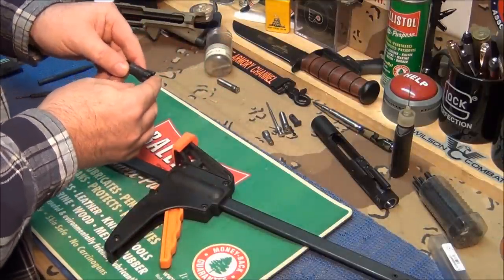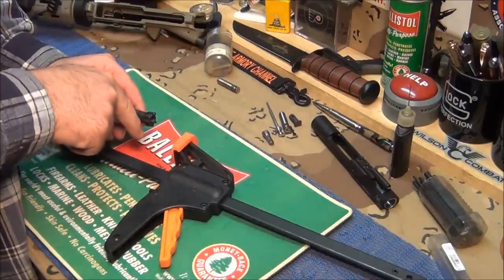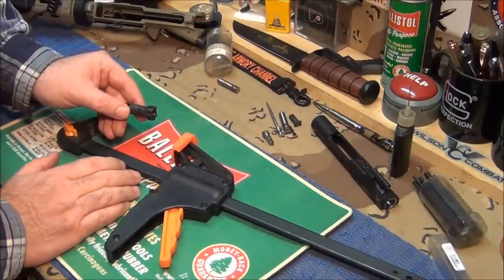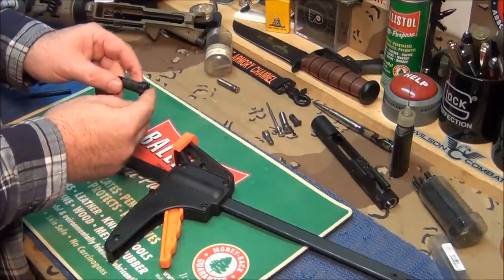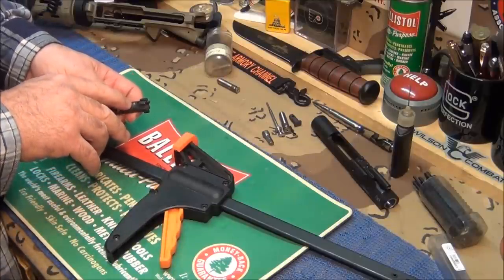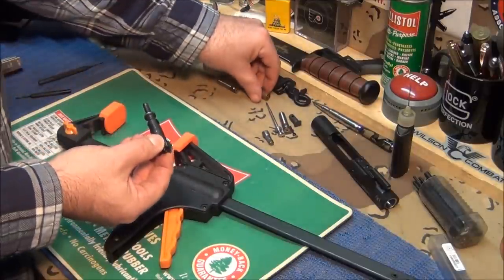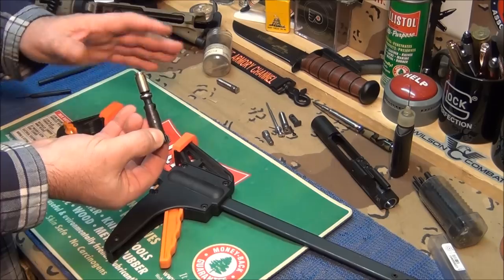Before I put it back, I need to know which way the pin goes in. If I drove the pin out this way, it's got to go back in from this way, just in case that hole is tapered. There is an 'MP' stamp on this side, so I will drive the pin in on the MP stamp side. I'll put that there - this is to protect the face so you don't squash it. It also gave me more of a base and kept it stable.